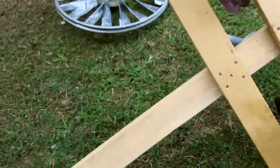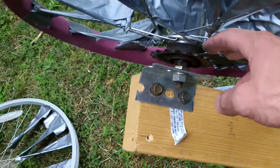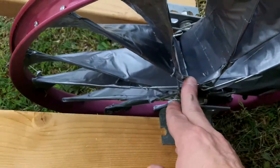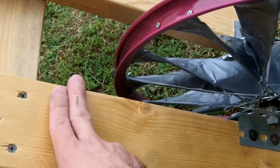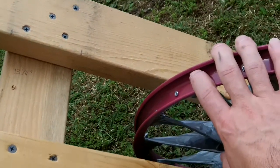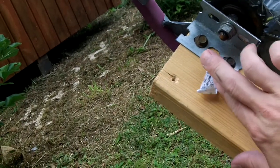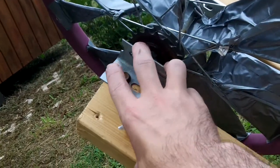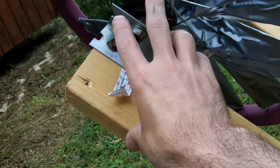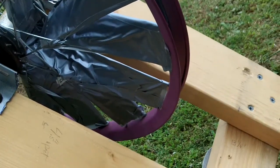A third option I could do — and I can't use this one because this is more of a brake — is attach some gears on the back here, which I do have a stockpile of, attach one there and one there, and do an individual chain drive for each one if these have enough torque to move that. Or another option would be to do a rotor and a stator, do a three-phase AC generator, and just go ahead and convert that to DC for my regulator at the end. So I have a few options on that.